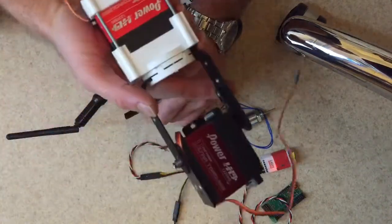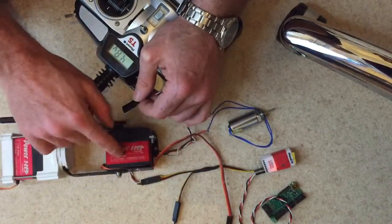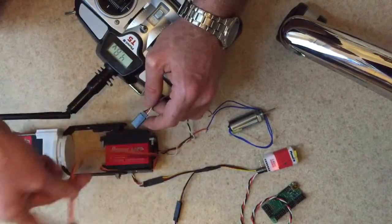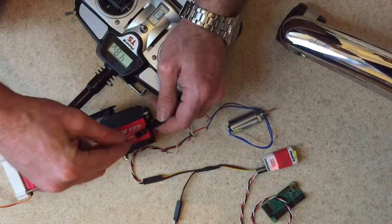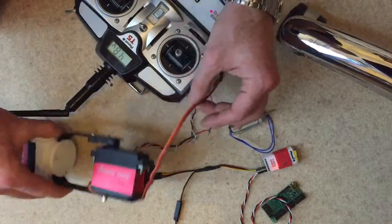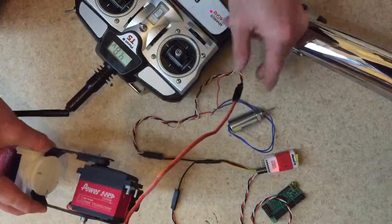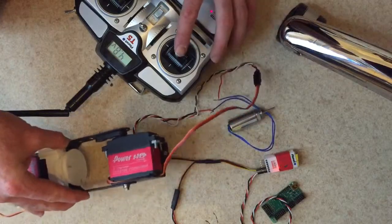When I start using the bigger ones, these have a holding current of 9 amps. They're 7.5 volts. Doesn't matter. The 7.5 volt works fine, because 1.5 volt doesn't make any difference in this problem. It doesn't cause any problems. Here, I am activating the power supply on the same line, same as that other one, and you can see the cable colors are correct.